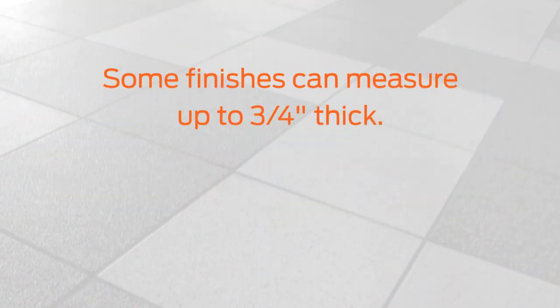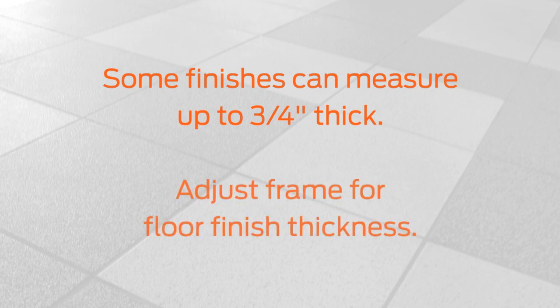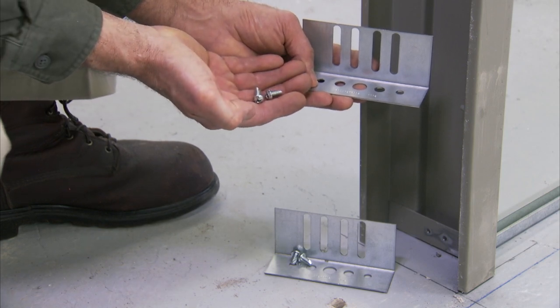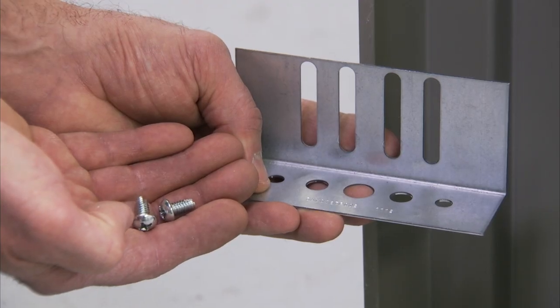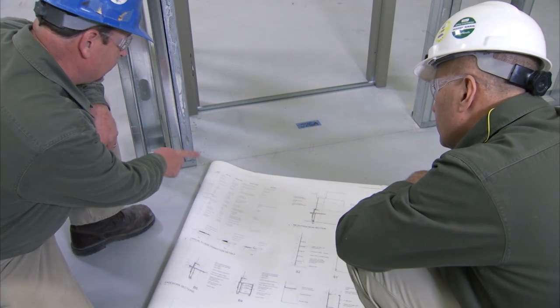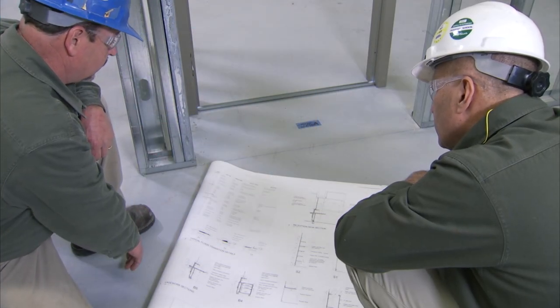Some wood and tile finishes, such as quarry, are up to ¾-inch thick. Frames may need to be adjusted off the subfloor for different thickness floor coverings. In this application, there are no additional floor coverings and no frame adjustment is required. Steelcraft frames are provided with adjustable base anchors that allow you to adapt for floor surfaces up to 1⅜ inches. Contact your job supervisor for verification of finished flooring.